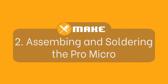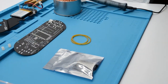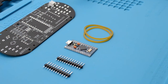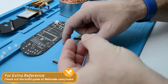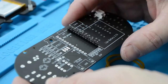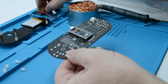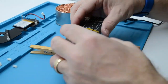Soldering and trimming the ProMicro. The first thing you want to do is unpack your ProMicro. You should get two sets of header pins and a PCB board with a lot of components surface mounted onto it — this is the ProMicro. Think of this as the motherboard of the console. Go ahead and grab your header pins and place them into the rear side of the PCB with the longer pins being pushed through the holes. Then place the ProMicro onto the header pins with the USB facing away from you. Use a rubber band to secure this in place so we can solder the parts together.